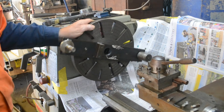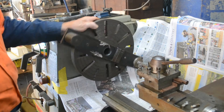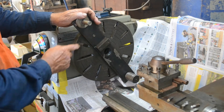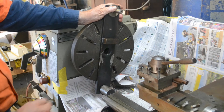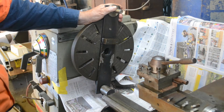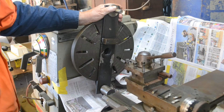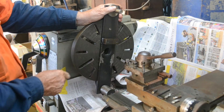Here's our setup. We've bolted — or cam locked — our face plate to the spindle of the machine, checked the disc is tight, and before I started I just bored that centre out. Just needed a little bit more to give us room for the boring bar to go through, and a little bit more clearance here for the tool so that we can face the end.